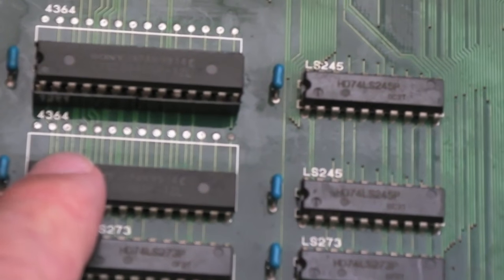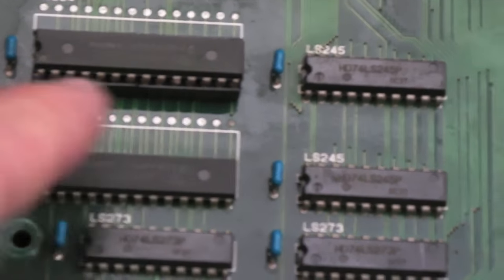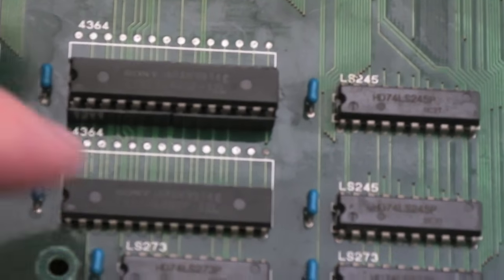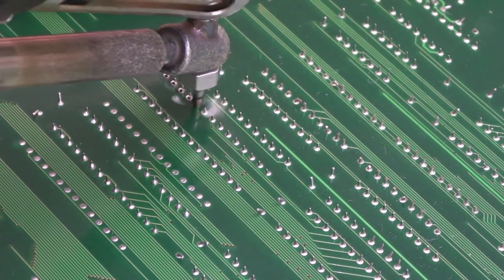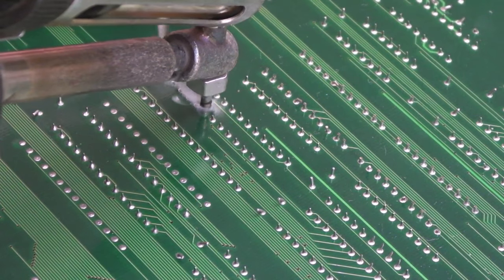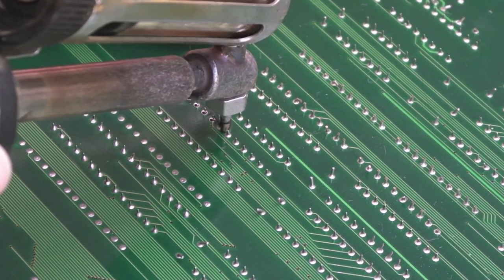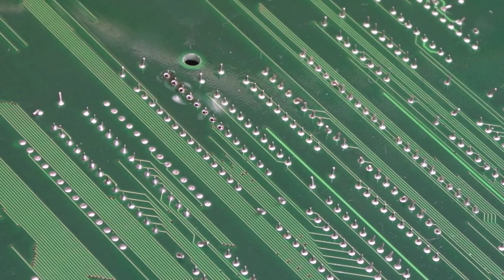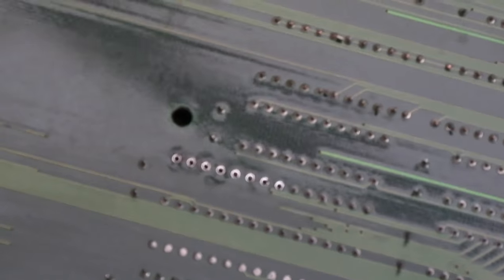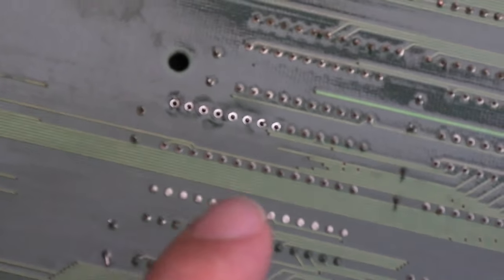I'll desolder a few of the pins just so you can see what's involved, and then I'll show you how to free up the pins to make sure you don't damage the board. Once it's socketed up we'll swap them around to see if the behaviour changes. I'm going through these pins now with a bit of solder flux using the desoldering station. You could use a desolder pump but it doesn't work as well on a board like this. Hopefully you can see most of the solder, if not all of it, is removed. Once I've finished that chip I'll show you the best way to free it up.